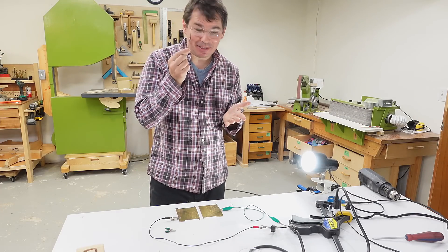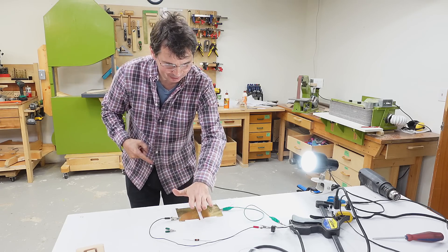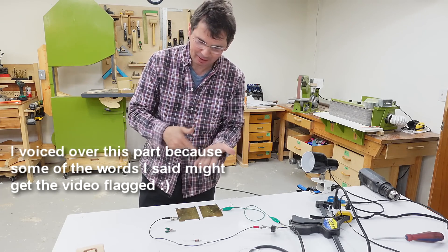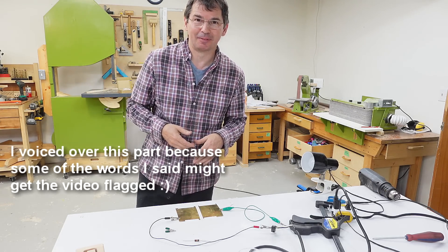And now I took out my safety resistor, so I'm really counting on that GFI to trip — otherwise it'll be very painful. But here goes. Once again it tripped immediately, and there was no sensation of any tingling or anything like that — probably just slapping my hand down overrode everything. Now had that GFCI failed, I'm sure that would have hurt quite a bit. But the way I had it set up, the juice couldn't really flow anywhere other than my hand, so I'm sure it would have been painful but I don't think it would have caused any injury.